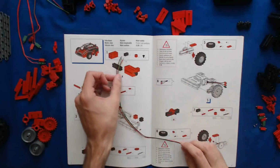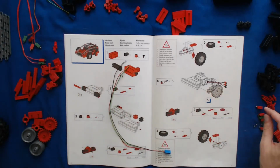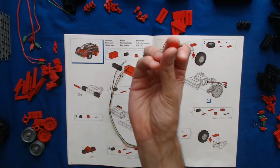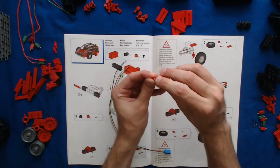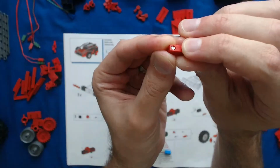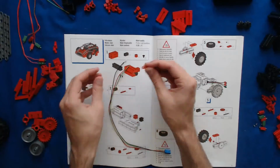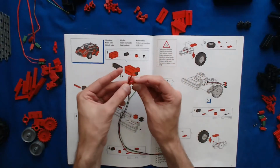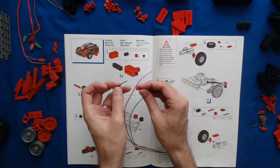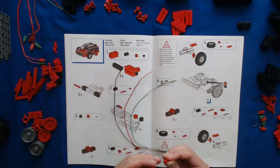When it comes to wiring these cables, there's a couple steps you need to do. In the diagrams here, we see that there are these casings on the end of the wires. I'm holding one of the red ones right here. It's kind of small, but you can see that there's a small flathead screw on this side of the casing. What we need to do is actually take that screw out. For each of these cables, we will push the metallic wire into there and then seal it back by screwing the screw back on. And that will allow the wire to conduct electricity through here.